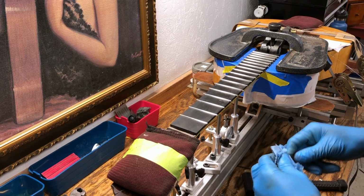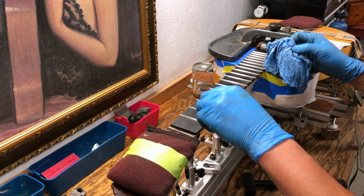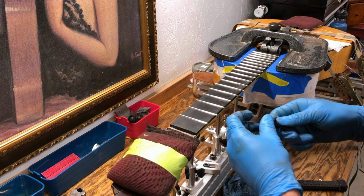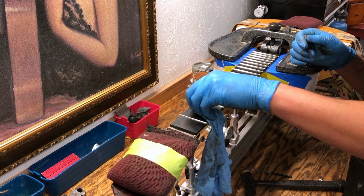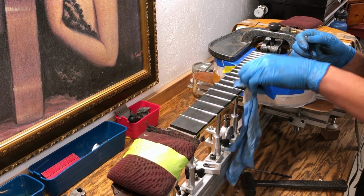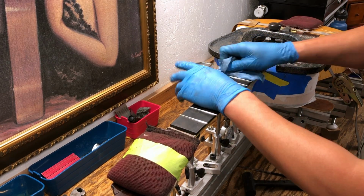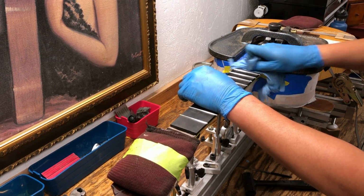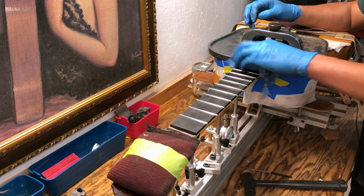Clean up glue, just a little ebony strip. Might let it dry more. It gets pretty flaky when it's dry. So fish glue is great. The only nemesis is water. It'll loosen up fairly quick, but I always finish the ends of the fret slot, so there's not a glue surface touching air.